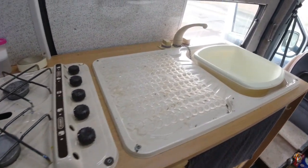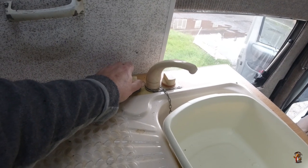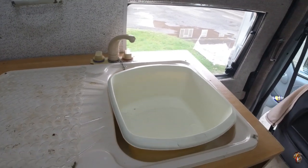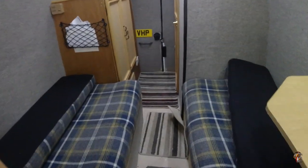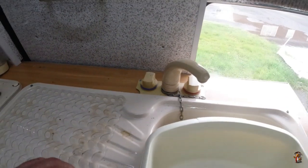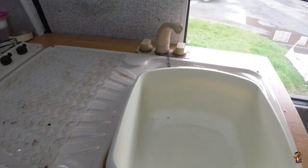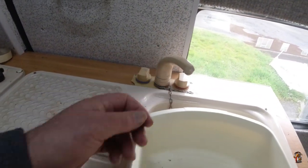I'm going to make a new unit and possibly change the taps. This is a mixer but it's micro-switched, so it's not a pressurized system. I don't really like the idea of a pressurized system because if you've got a leak it's continuously pumping — especially as my pump is inside underneath the wardrobe and I can't even hear it. I'll stay on a micro-switch, maybe with a push-button horn switch. I also need to get a one-way valve because when the tap is on and the pump isn't running, it siphons back to the tank.